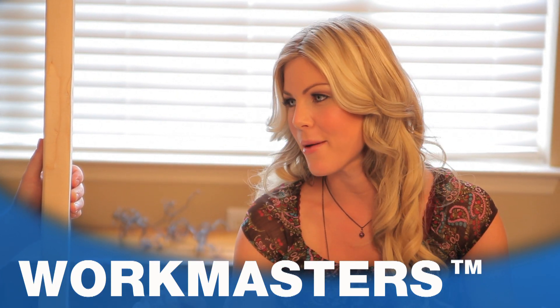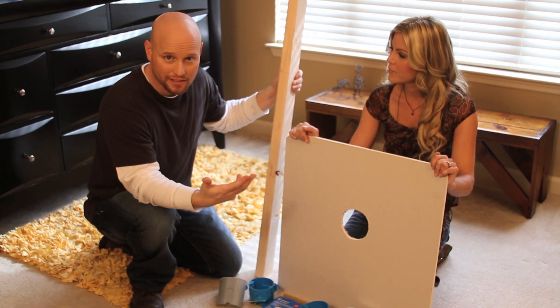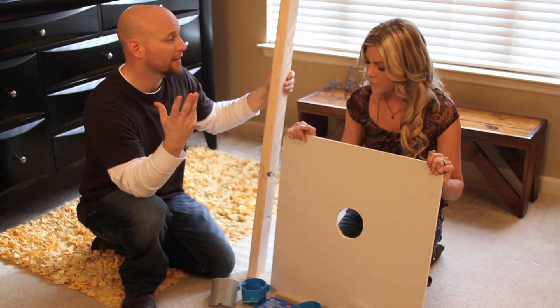So how do you know it's safe to hang a ceiling fan up there? That's a great question. Fan boxes, or electrical boxes — there's a bunch of different boxes and not all of them are rated to hang a ceiling fan. So you have to verify that it is safe to hang a ceiling fan in that location.